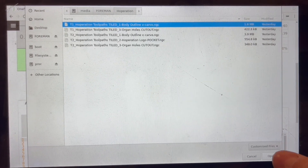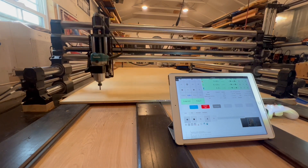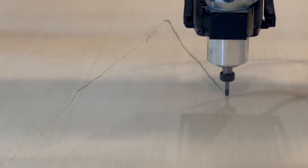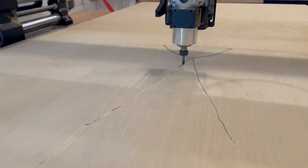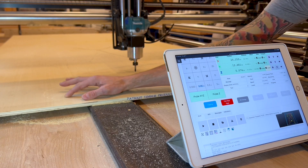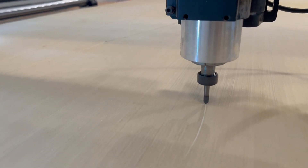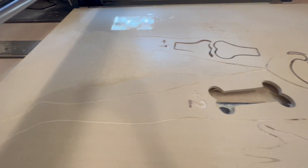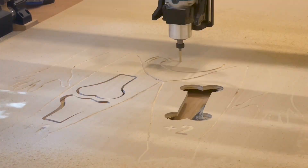Let's open T1 Body Outline and fire it up. It looks like my worries about the material flatness were justified — it seems to be sticking up higher toward the middle of the sheet, so the bit was cutting deeper, resulting in a wider outline. I'm not too worried about it though because I'm using a V-bit, and as it travels along these vectors going from shallow to deep, the transition is gradual. The lines are going to be a little bit thicker toward the center, but that's not going to affect the design too much. Aside from some flatness issues, I'm pretty happy with how the bottom half came out.